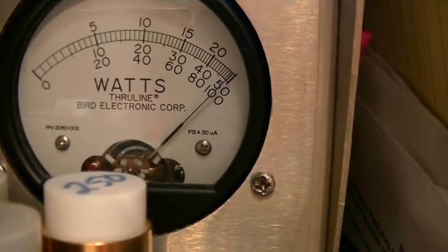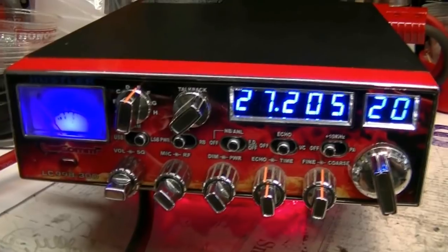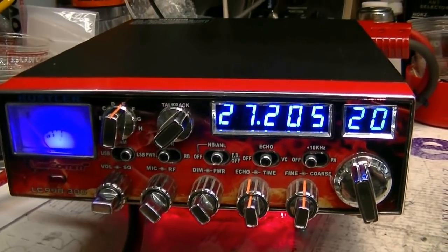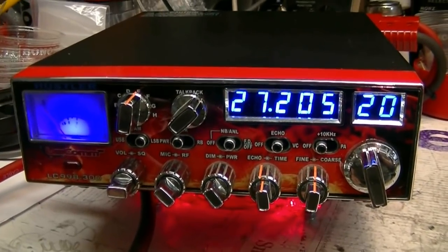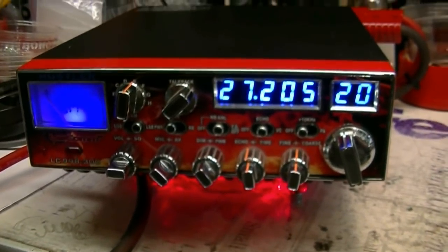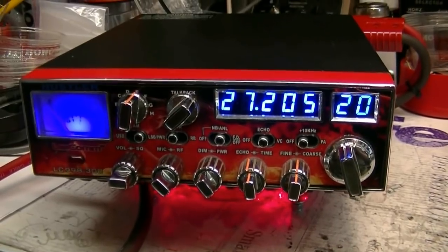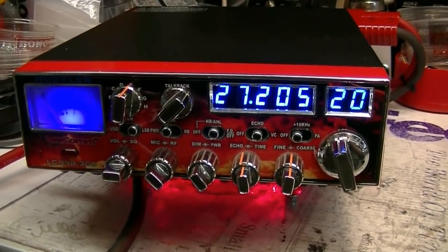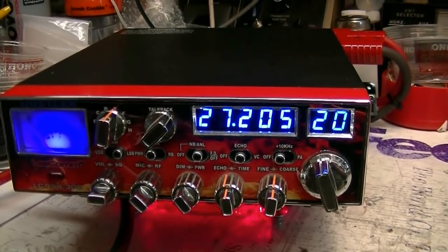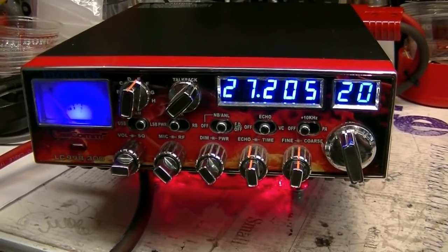It's not even straining to put this thing over 1,000 watts. This combination — the 2879s and the 2970s — they will definitely put out some power. Okay Sam, sure hope you enjoy your radio. Got the upgrade all done up for you. Got the 4AWG power cable — I still need to make the part that goes inside your vehicle, but you're all set. Should go out probably next Monday or Tuesday. Like I said, I've got to do the 24-hour burn-in first.